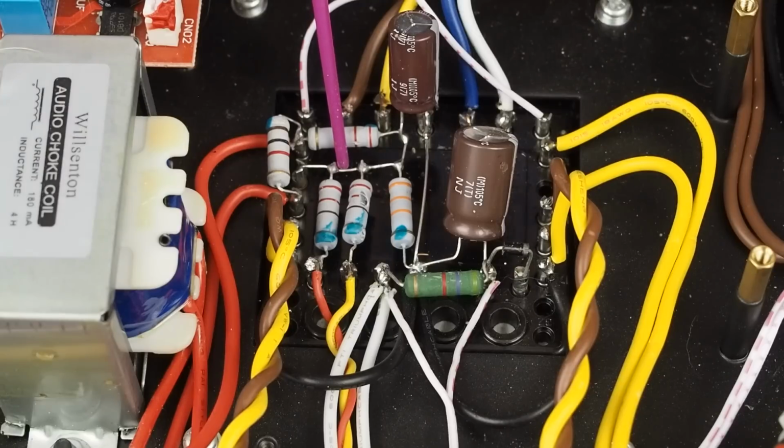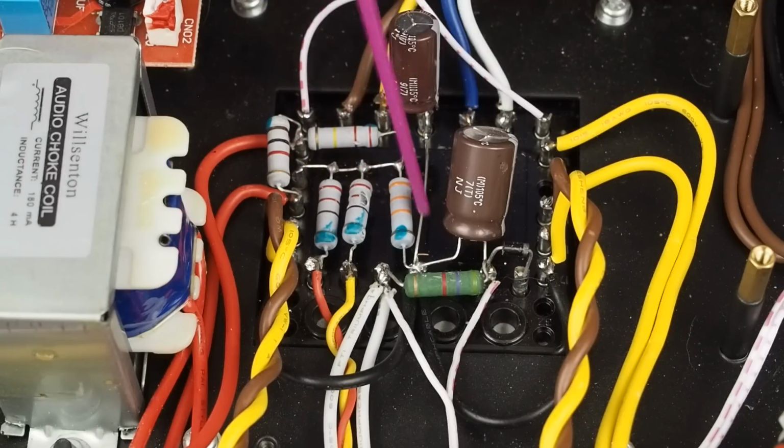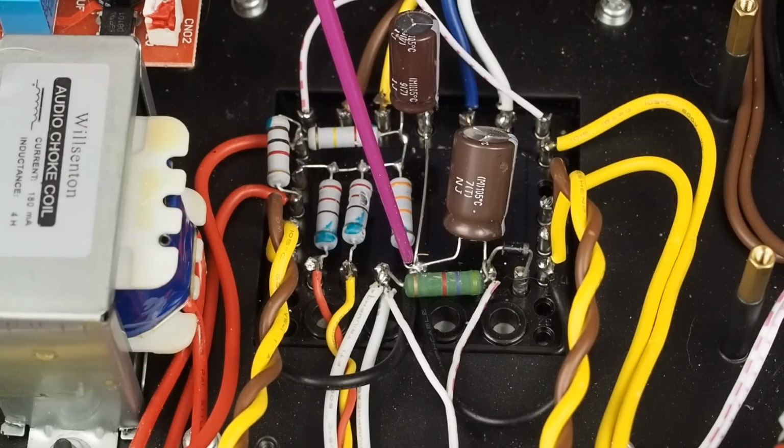Normally you would pick, let's say one of the cathodes is at 150 volts and the other one's at 0. You'd raise this up to about 70 volts, so it would be halfway between the two, because you're not supposed to have over 100 volts between the cathode and the heater. And that's what they're doing here, is to make sure that doesn't happen. And I'm going to be measuring this voltage just to see what they've set it at before we start changing all this. But I'm going to replace all these resistors. This cap is going from the center tap to the ground, which is commonly done.